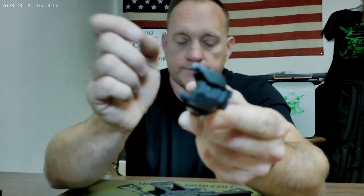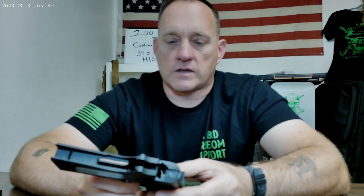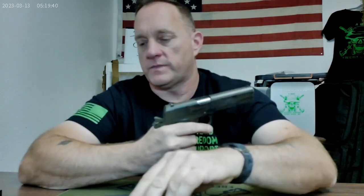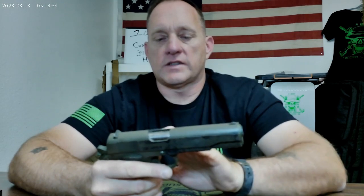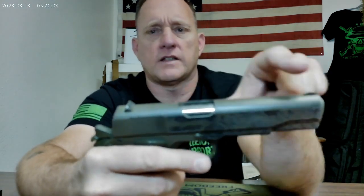Some of the other things he mentioned: a tight fit in a 1911 is more accurate — absolutely. I'll go into that on three points. In your slide, you have rails that are cut. When rails are cut into your pistol frame, your slide rails have to match those dimensions and be happy. If you get these tolerances nice and tight, you'll get a slide that doesn't wiggle around. Some of us have been out looking at used firearms and noticed you can grab the slide and wiggle the frame around. This Auto Ordnance D-Day Commemorative is actually pretty tight — there's just a little bit of wiggle. If your slide is good and tight, that's going to maintain your sight alignment as you're firing, because your sights are on your slide.